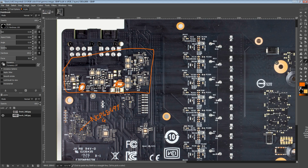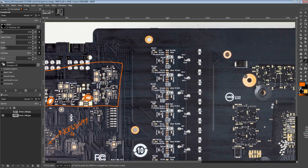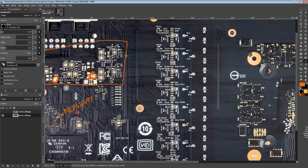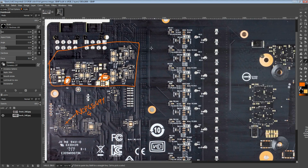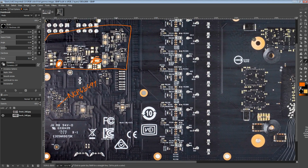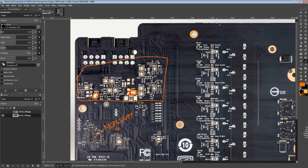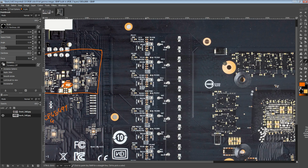In some cases it actually causes potential issues, like the RX 480, where it was like, well, I guess we're pulling a little bit more than spec from the PCIe slot, which in my opinion is not an issue, but there was a whole lot of controversy over that. But whatever. So I think that's kind of neat. Some people might disagree with that, but whatever. There's no current balancing circuitry on here, and I assume MSI just has a really high power limit on this card to basically get around that.